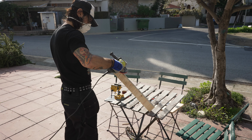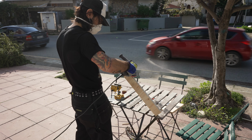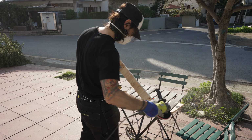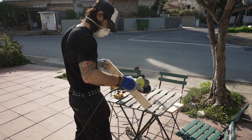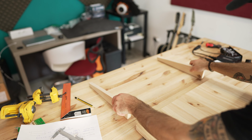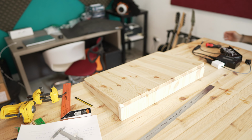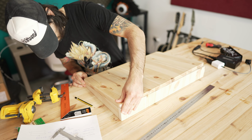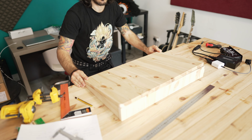The top side of the front member needed to have a 7-degree angle to follow the angle of the cover, and since I didn't own an angle saw or any other tool that would do that, I tried shaping it manually. After about 20 minutes of manual shaping and putting the pieces together to see if they would fit, I learned my lesson, that you cannot accomplish a completely level edge with the hand. You need the right tools for that.